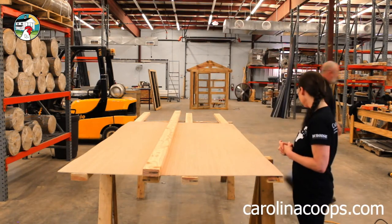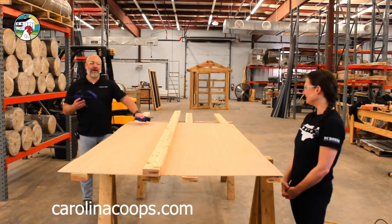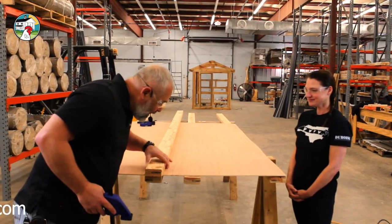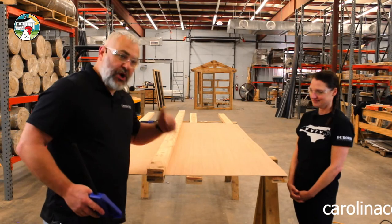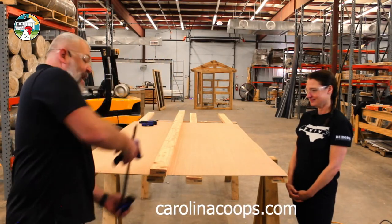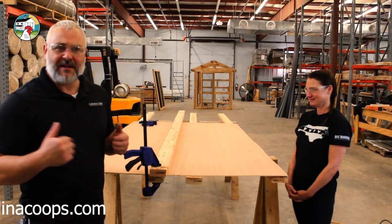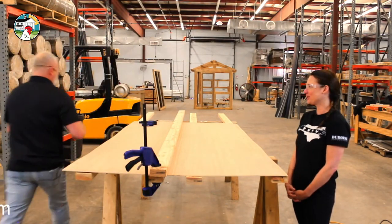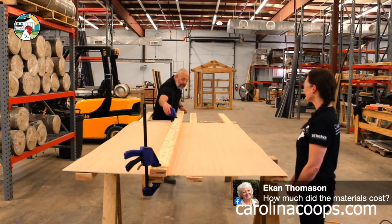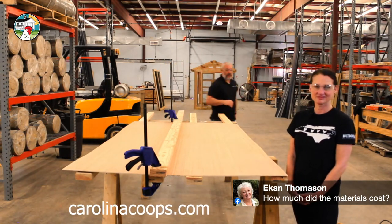This is a good option as long as you don't have a hundred of them — or three hundred, like we did one time. What I'm doing now is showing a little tip: if you're worried about cutting it straight, just use a straight edge. I figured out my offset from the base of the saw — I still want the cut to be right in half — so I come over an inch and a half and put my straight edge there with quick clamps. Most people should have those. Do you guys like this? Do you like seeing us out of the studio?